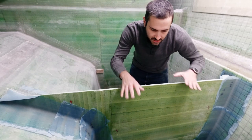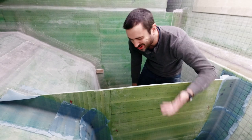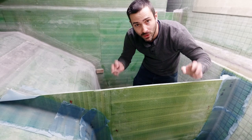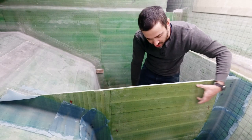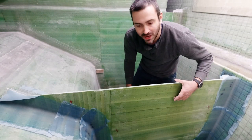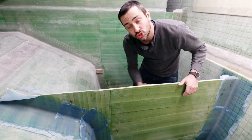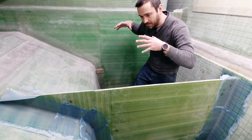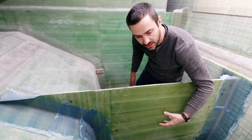What we'll end up doing is once we get those in place, then we can at least temporarily, for the time being, roughly cut out this bulkhead and make it a ring frame. So it'll be roughly 150 millimeters along the top, about 200 millimeters around the side. But what I'll do just today is I'll cut 200 millimeters all the way around and then we'll trim that back later. The way the engine's gonna sit is the engine will sit back here, but the front end of it will stick past into this area a little bit.